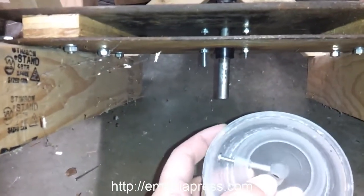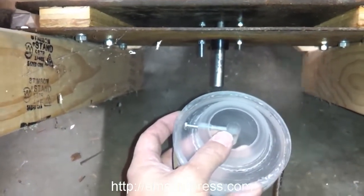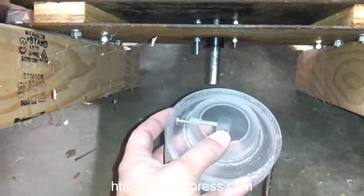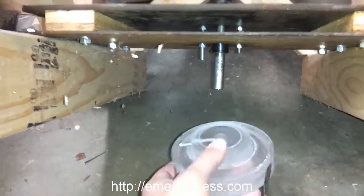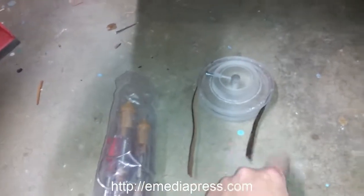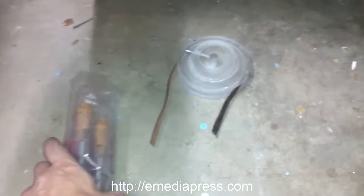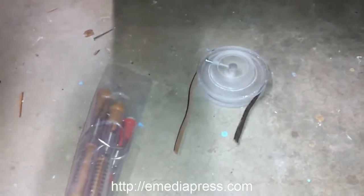But anyway, down here, this all kind of roughed up. That's because of using this wheel right here. The circumference that the leather strap is on is exactly 12 inches around, so you can calculate 1 foot-pound of torque based on 12 inches circumference. And so when that's connected up here and screwed on, as it's spinning, you can take this leather strap and you can put these spring-loaded scales on it, and you can see how many pounds of deflection, and basically you can calculate the torque. It's an old school way. It's basically an old school dyno kind of that will tell you exactly what the mechanical work is.